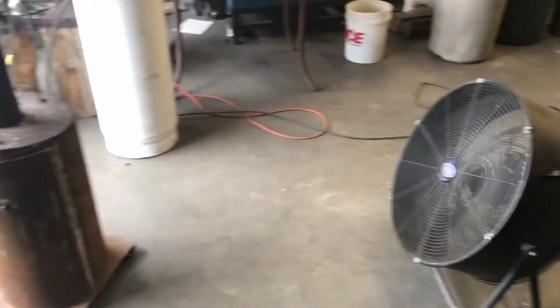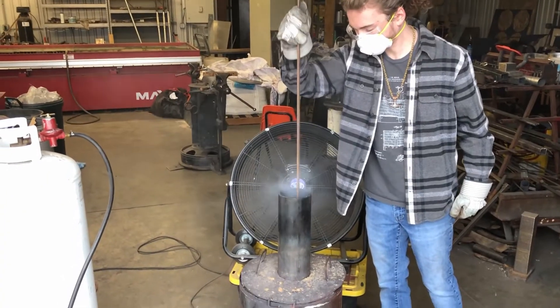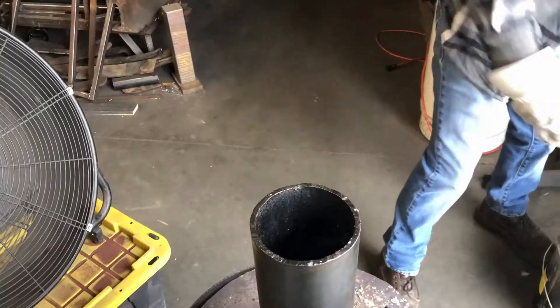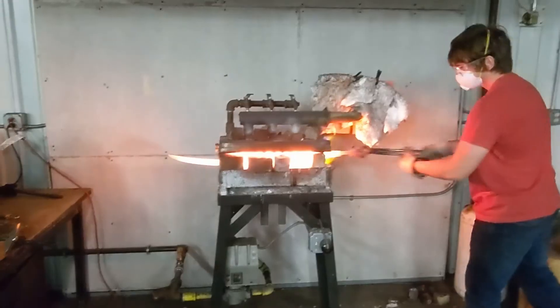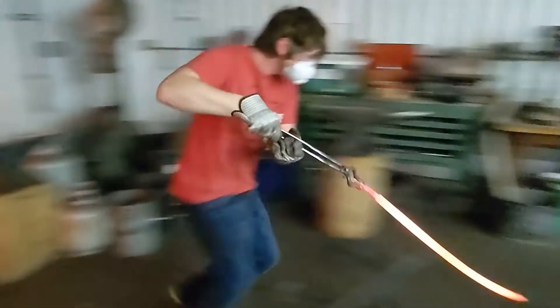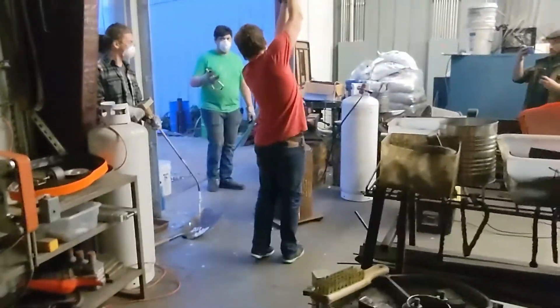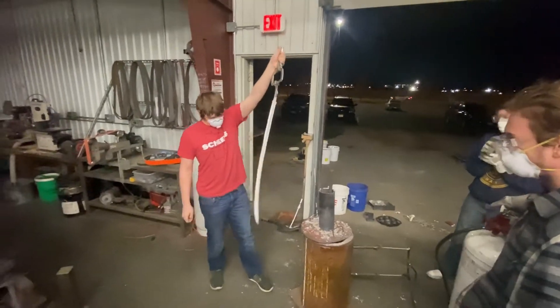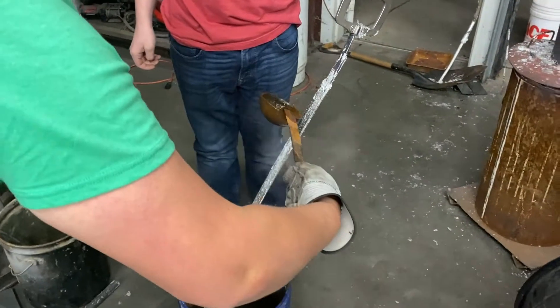In order to maintain safety while working with molten lead, we held a fan blowing fumes out of the garage as well as wearing masks and eye protection. Straight from austenitizing, the blade was quenched in a molten lead bath and held for an hour. The temperature was maintained with a pyrometer and frequent agitation.